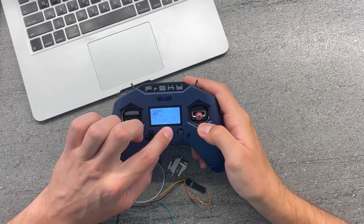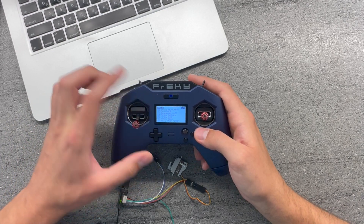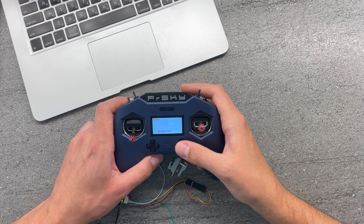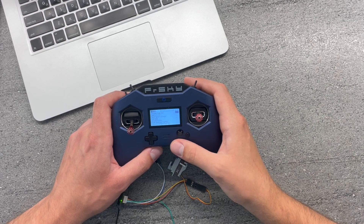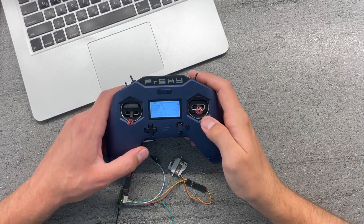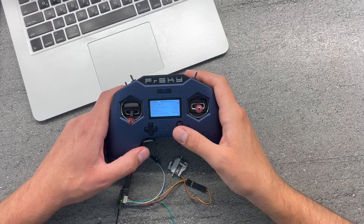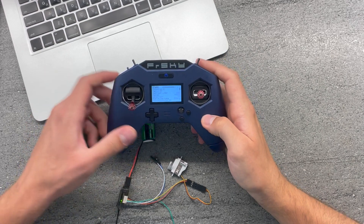So when you have your Lua script uploaded to the SD card, press left once to go to the radio setup. If you uploaded it into the Tools folder, you will be able to find your script right here. Here we go — FrSky Servo B1. Just press and wait for the sensors to load. Here we go — we have a physical ID, a servo ID, a refresh timer, and all the different parameters, which is great. Now first of all, let's get our servo moving so we can play around with these settings.